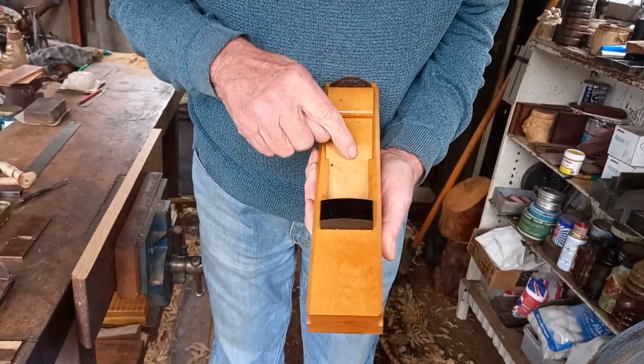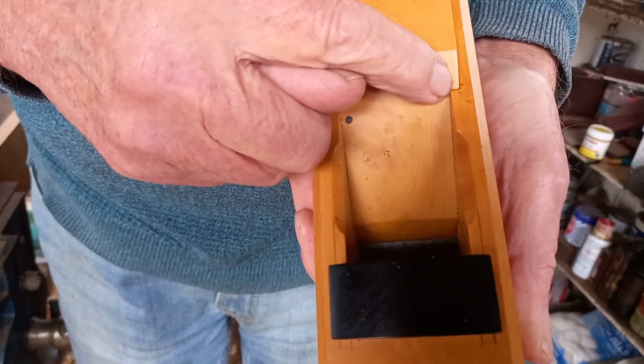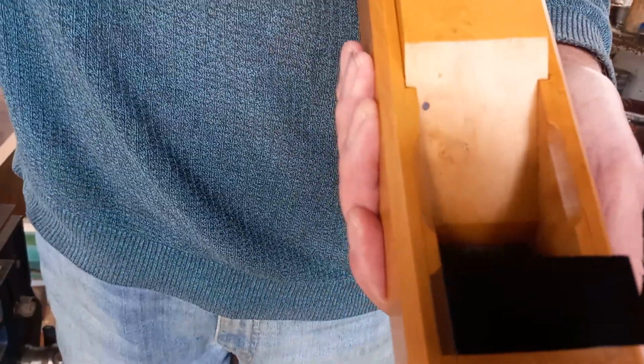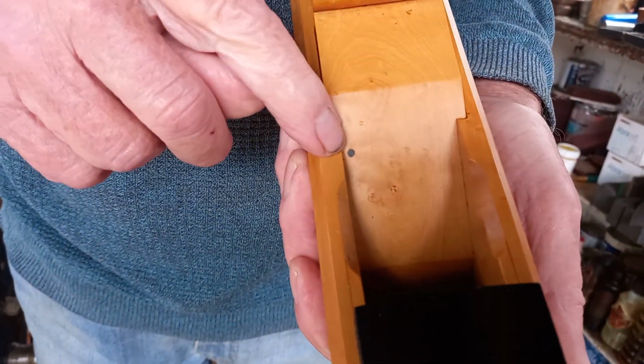When you let the wedge in, you have to go a minimum of 1/8 of an inch. In boxwood that's very strong. In beech probably a little over 1/8 of an inch, right?